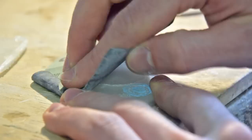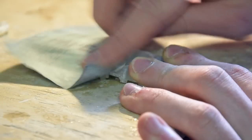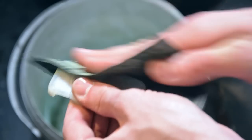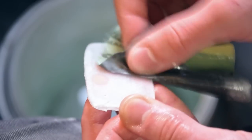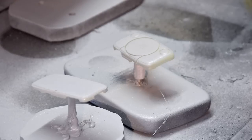After a first coat of paint, we will see the defects more clearly. But before that, it's a good idea to start sanding the outer surface of the case. Since this is a 3D print, there will be cracks and crevices corresponding to the movement of the nozzle. The case will require a lot of sanding to eliminate those. After a little bit of sanding and water sanding, the first coat of spray paint is applied.